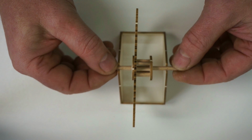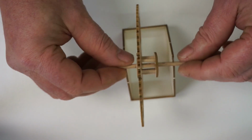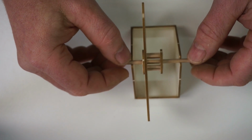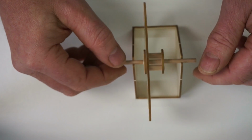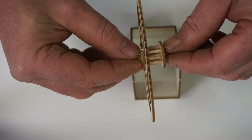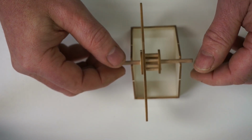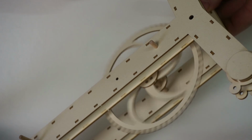As you have certainly noticed, the cog does have some wobble issues. At 90 degrees to the arbor would be the ideal line. So to correct this wobble, the cog needs to be pushed in this direction. Using gentle pressure, keep tweaking until you have eliminated most of the wobble. You should finish this stage before the glue has set. The cog does not need to be 100% true, as it is a clock we are building and not a Formula 1 racing car.